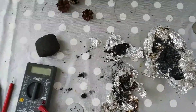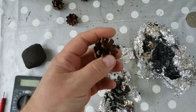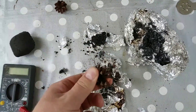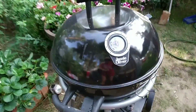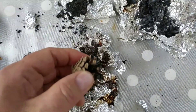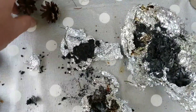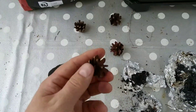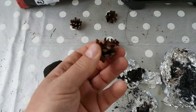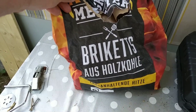This is Stefan again, I'm back. I just wanted to show you how conductive now this pine wood, pine cones are. I put these pine cones into aluminium foil and put this on the grill for barbecue, and heated it up very good for maybe an hour or something like this. Let it cool down then, and it's pretty conductive now. So we have a nice production method for these pine cones, which are normally waste products from your garden. And we want to compare it with something like these briquettes from charcoal.